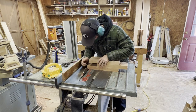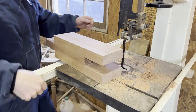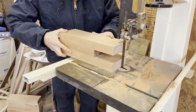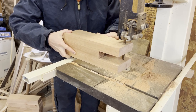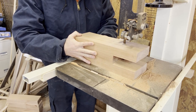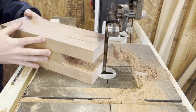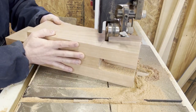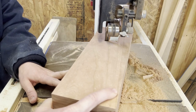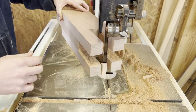The middle board sticking out the bottom is not exactly the right distance from the top, so I'm just cutting it to size so the sides and footboards of the bed will sit flush with the top. Then I measured for the other side of the castle joint and took it to the bandsaw — I figured this would be the easiest way to cut that side of the joint. I do have a dado stack, but it's on a 10-inch saw and the dado stack is only eight inches, so it wouldn't be anywhere near the depth I'd need.